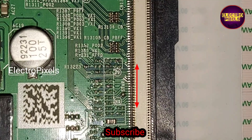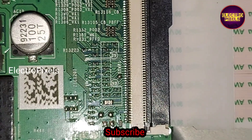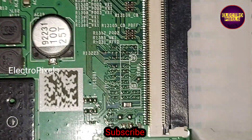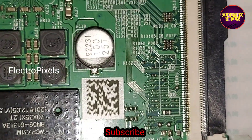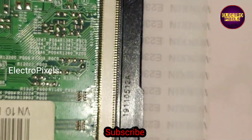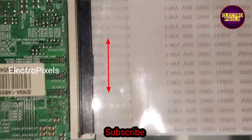Today I'm going to show you the gate signal tracks on both sides. This will help you solve panel-related issues like double image, lines appearing on the screen, or blank display. For these types of symptoms, you can solve the issue by blocking the gate signal tracks either from the left side or the right side. In this video I am going to show you the marked gate signal tracks.